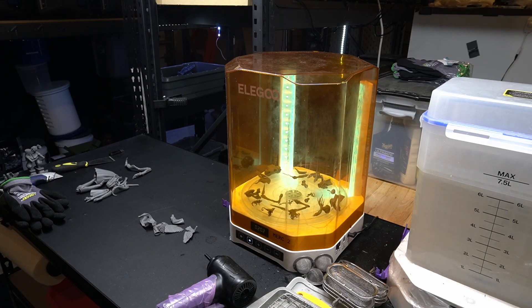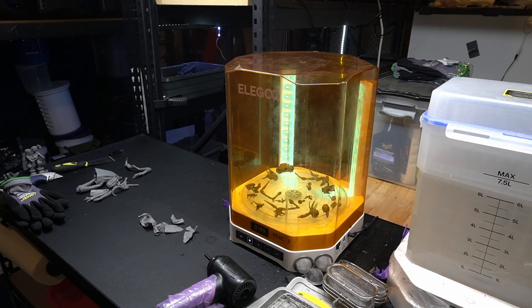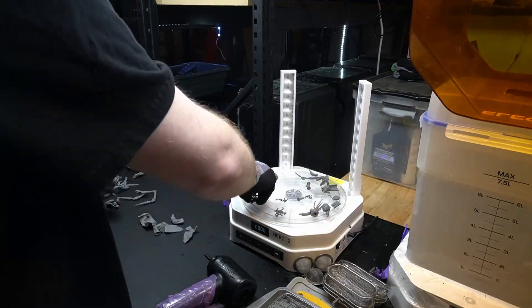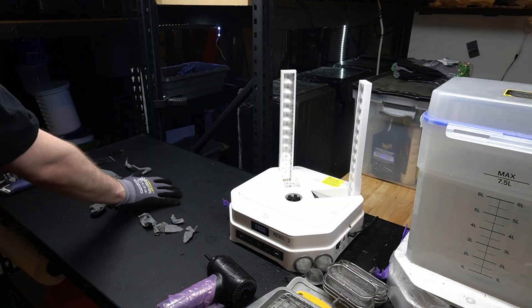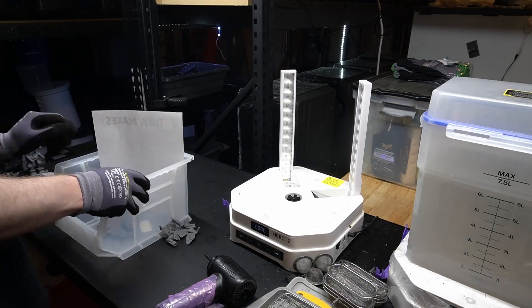Once that's done, parts are going to be cured on one of the Mercury V3 Pluses. I cure things for anywhere from four to maybe eight minutes depending on how big the parts are. If they're really big or really deep — like a big hollow base part with holes so UV light can get in — I want to make sure it has enough time. So I vary the cure time based on what kind of parts I'm putting on the plate. For the parts in this clip it's about four minutes. After curing, I group the parts by model, especially if I'm working with multiple models at the same time, split them out, make sure I know which parts go where, put them into my order bins, and then they go down to shipping.